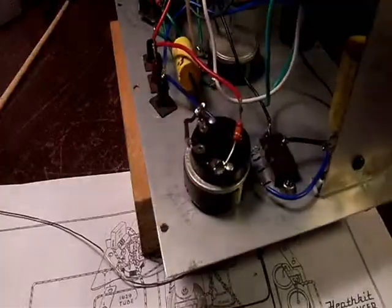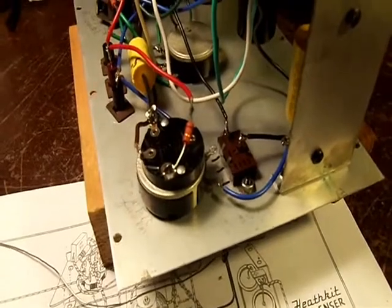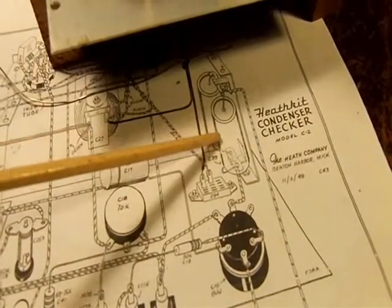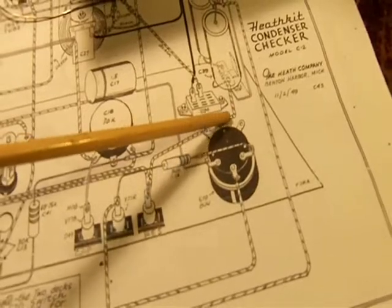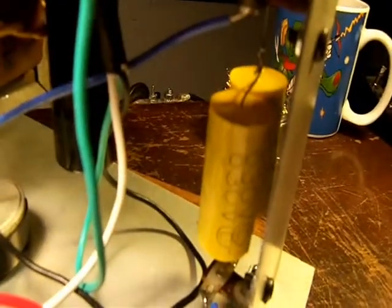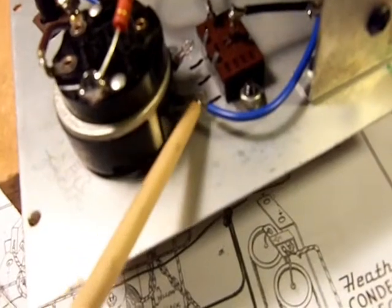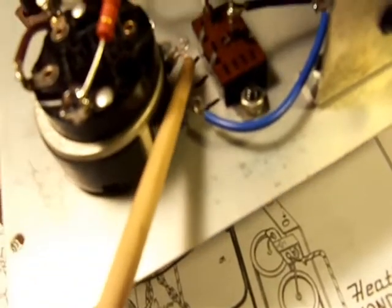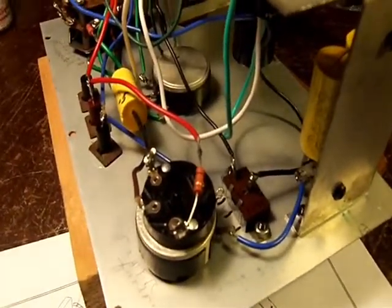While I'm out giving lectures about what to do and what not to do, I think I'll give myself a lecture. Here's a matched pair of one-microfarad capacitors in parallel — gives you a total of two. The lead goes to the center terminal on the power factor switch, right there. And look what terminal I put it on — and to boot, I didn't even solder it. There's the center terminal — nobody home. So, like it says in the instructions: double check the wiring.